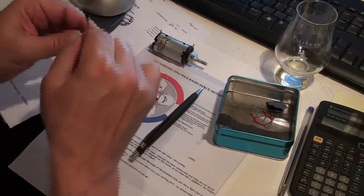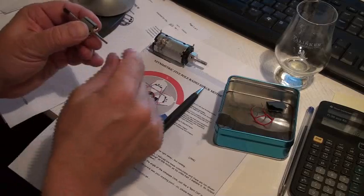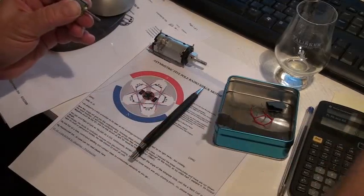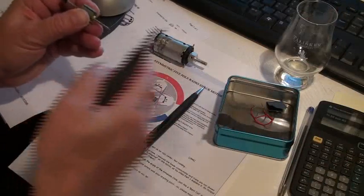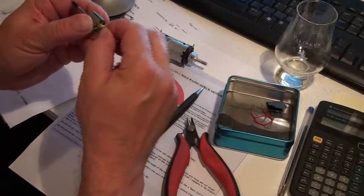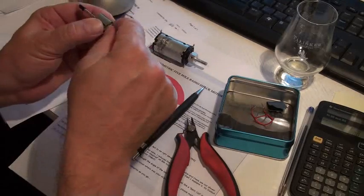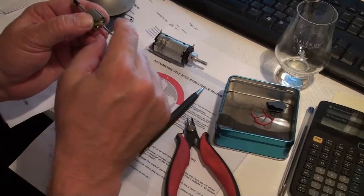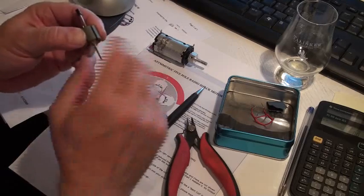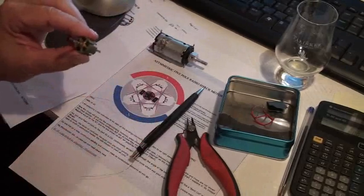You go on and finish on the outside — you begin here and finish on the other side. You have to cut here, then burn the wire end and connect it to the collector — always the same collector. Then the next coil will connect to the next collector.